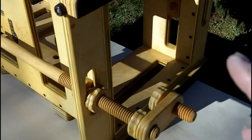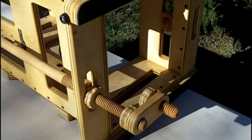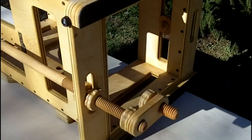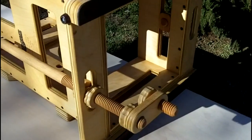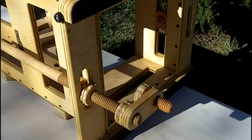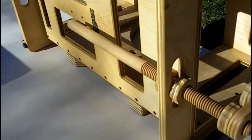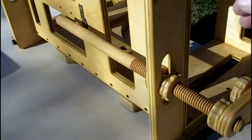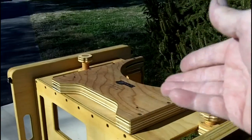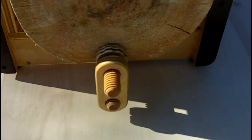In fact, this particular jig, this 12x12, will complement not only a 10x10 that they already have, but also an 8x8. I believe they've got all three sizes now that are common, although we can build any size saddle notch jig. But anyway, that's the stop. As you can see, there's a lot of adjustment in here, and it'll actually give us some extension between the center line of the saddle notch and the end of the log. And this will give you some idea how that looks.